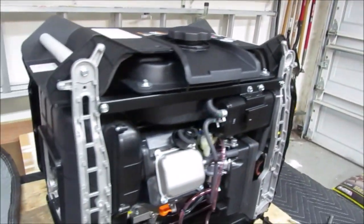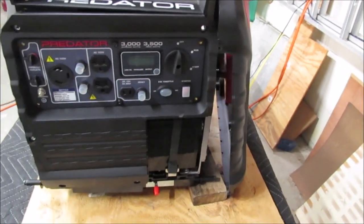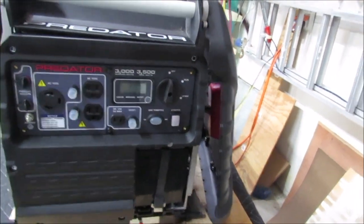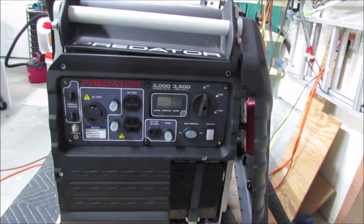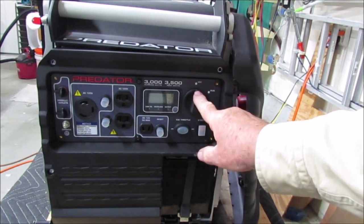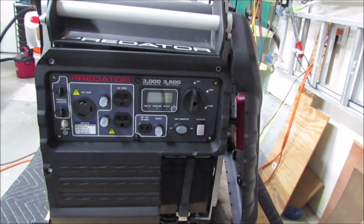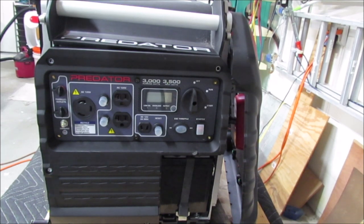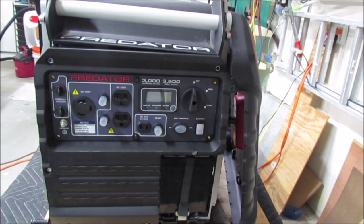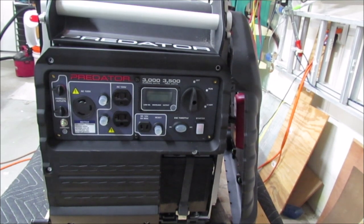Let me take you on a little tour. This is the rear — I've got the rear covers off. This is the front, and I did some disassembly here. Behind this panel there's a connector used with this on/off multifunction switch. When it's in the off position, it grounds the ignition so the engine dies. I disconnected that, and I already disconnected the oil switch. As far as I know, those are the only two kill functions on this generator.